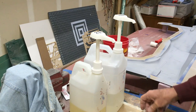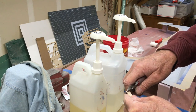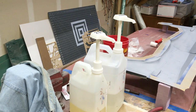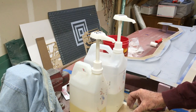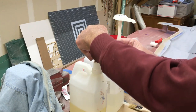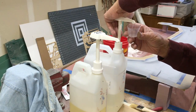Now I'm getting ready to mix the splooge, which I use for filling all the crevices. I use a mixing stick — just a popsicle stick with the ends squared off — which lets me mix into the bucket a lot better. We'll put in 10 milliliters of hardener, then 20 milliliters of resin.